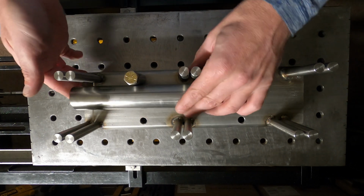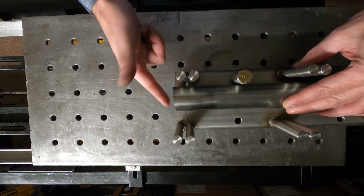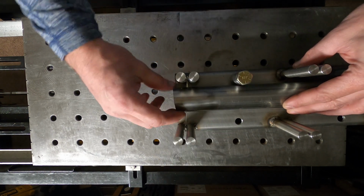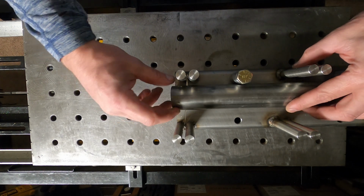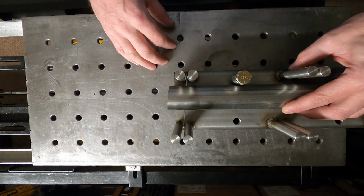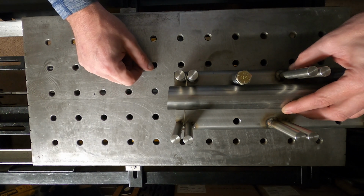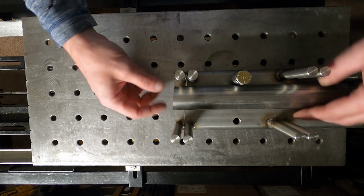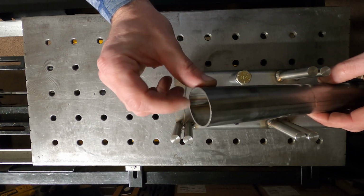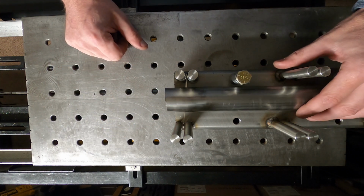But you back this up to it, bring it out here, touch off on the edge. This one's already cut at 15. You just back up the center to it and you make your slice. And then you roll it out, twist it 180 degrees, make your slice again, and you keep doing that. You keep alternating back and forth. And what you can do is with these tubes, if it's seamless or it's actually welded rolled, then what you can do is you just match up that seam right there, either right there or the actual weld from the machine. And it's real simple, works nice.